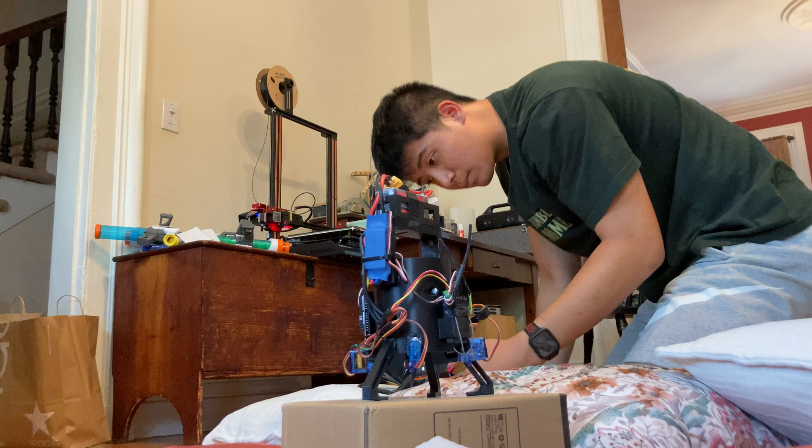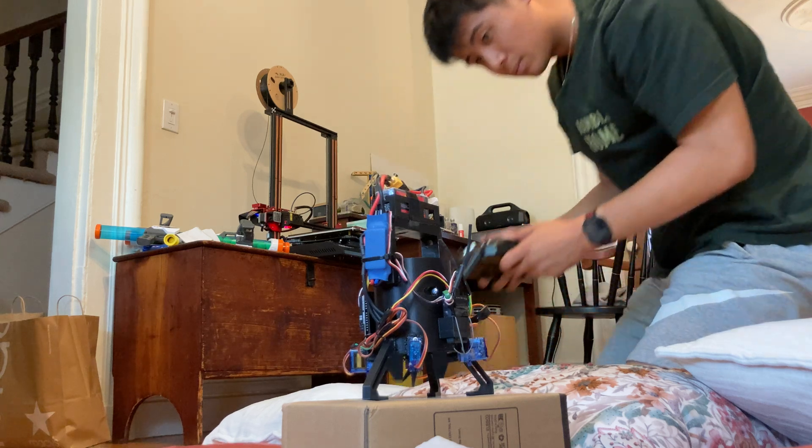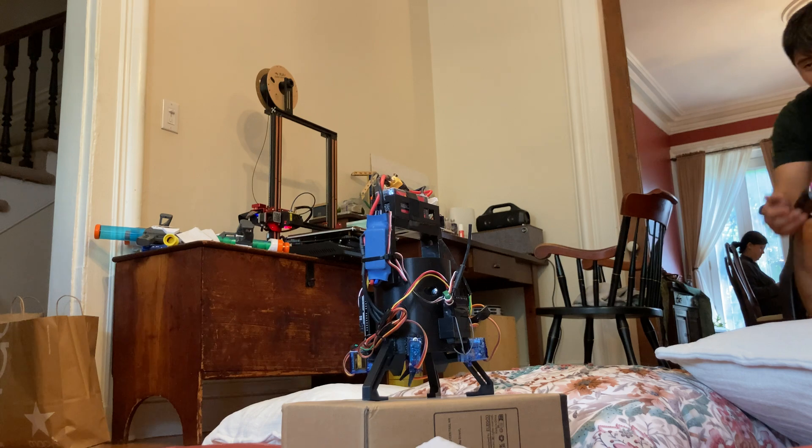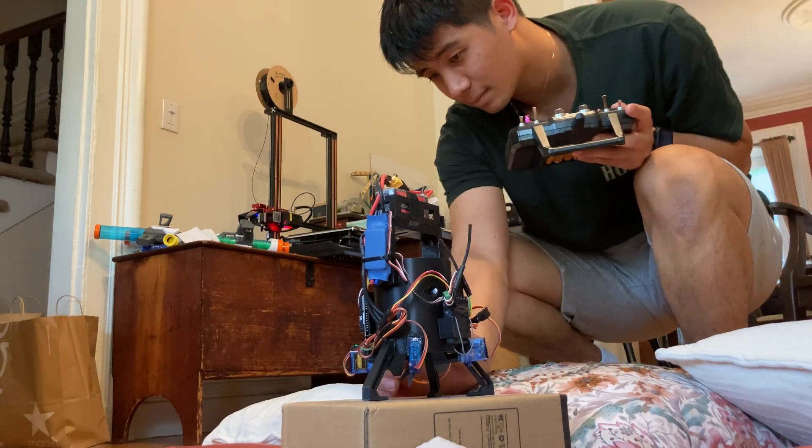Based on the testing, I'm guessing that balance is my number one issue. I figured that once I balanced the battery — again the heaviest component by far — the unit would be fine. However, it's very clearly weighted on the Arduino side for some reason, so the smaller components probably play a bigger role in balance than I thought. Regardless of balance, I expected better throttle performance — I used about 80% throttle to even get off the ground, and I clearly need to redesign the EDF intake, exhaust, and thrust vanes to optimize the power output.